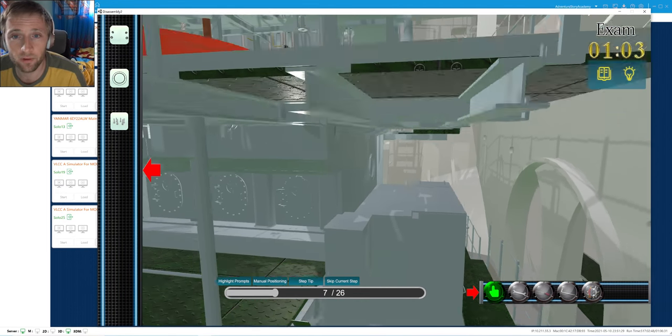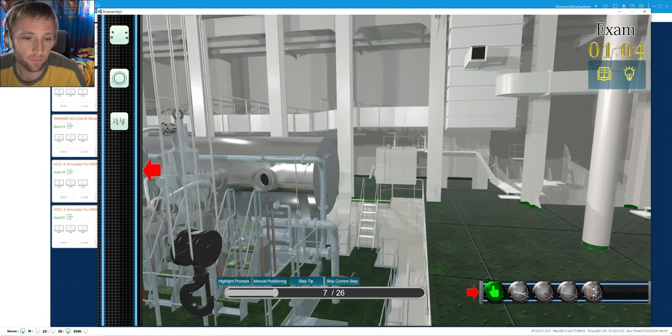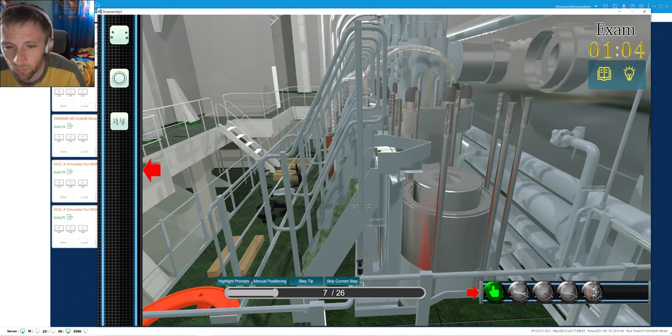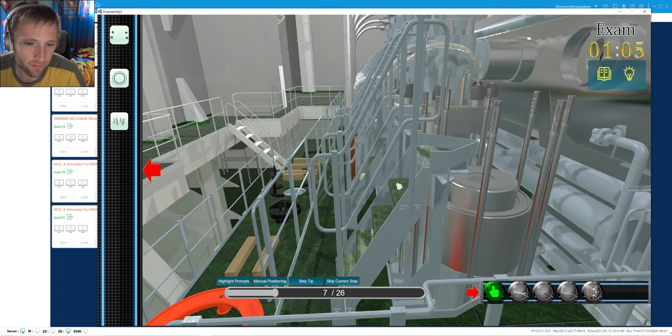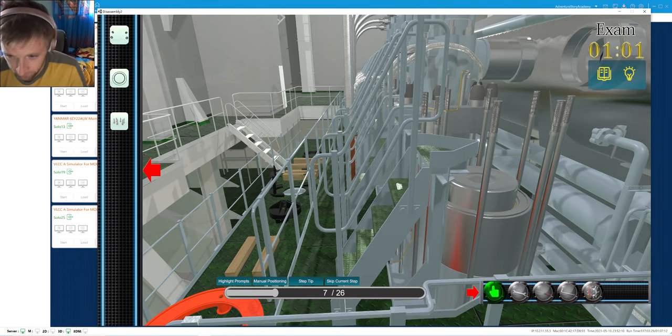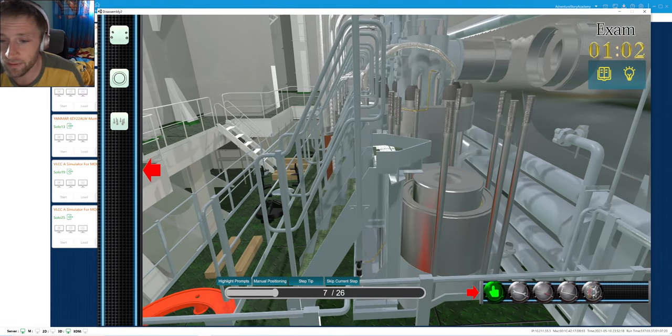Now we are going up. Here is our piston. By removing the top ring - the scraper ring, the piston cleaning ring - it will be easier to remove the piston without making any scratches. Really important: before bringing the piston to top dead center, clean the surface around so it will not get stuck on the piston rings. You can see the piston at top dead center by checking the flywheel.